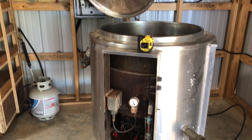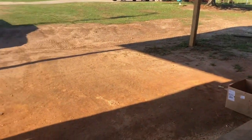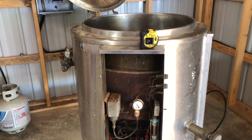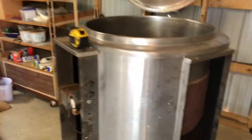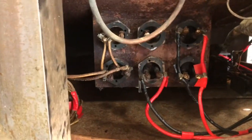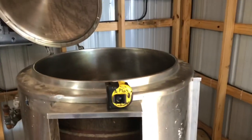Now don't try this at home - I'm no electrician, even though I'm doing all the wiring in my shop, trying to make it look neat and professional. But I do study a lot and I know a lot of smart people. This thing draws a ton of electricity - it comes designed for three-phase power running on 240 volts and it pulls 101 amps set up that way. It has a kit, and this one had been modified for single-phase power - it just puts a bigger terminal block in it. We disconnected three of those six heating elements, just like what's in your water heater.